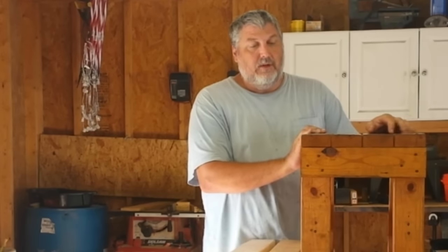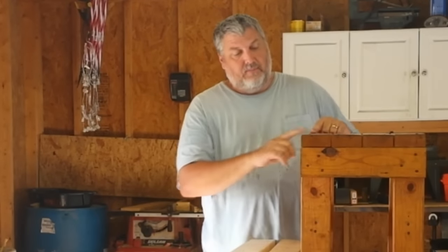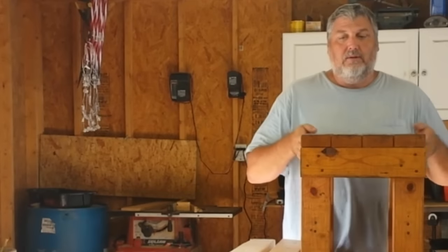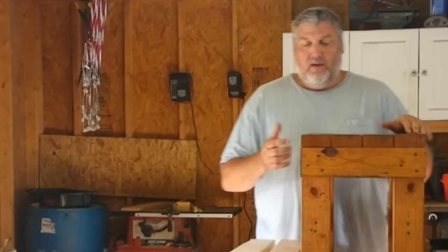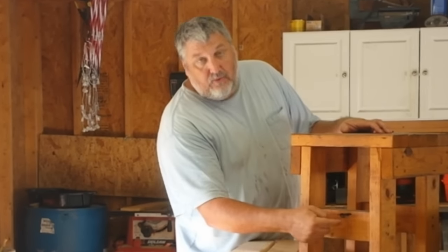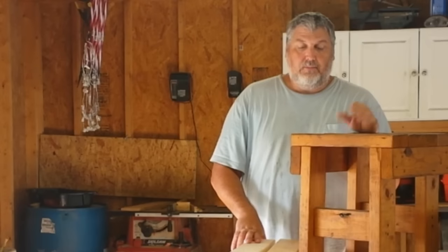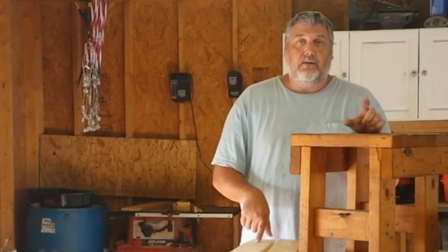We're keeping that size as well. The only thing I would probably do different if you want a more comfortable bench is to route these off — the side edges. The 2x4 is pretty smooth anyway, but you might want to route these side edges so it doesn't matter which way you turn it. But we usually just make sure we have the smoother side there. It makes it easy to put together. So you'll need 6 at 14 inches — 4 for the top and 2 for the sides. You'll need 4 at 14 and a half and 2 at 8 inches, and then it'll come out with just a little bit extra on both boards. You just put it together and screw it down. We stained it just because it was going to be outside.